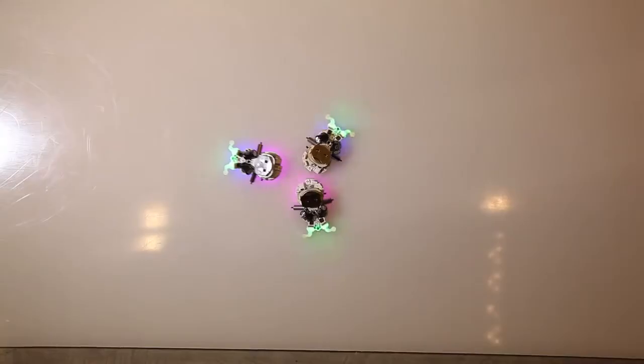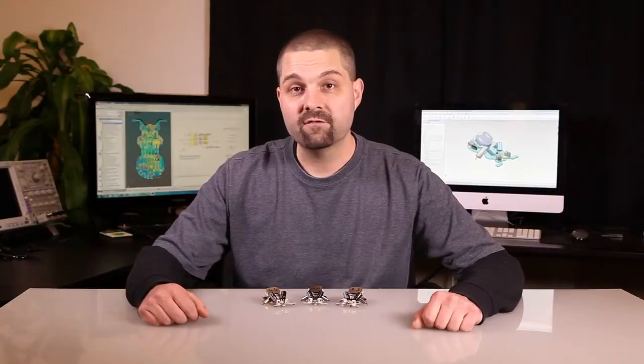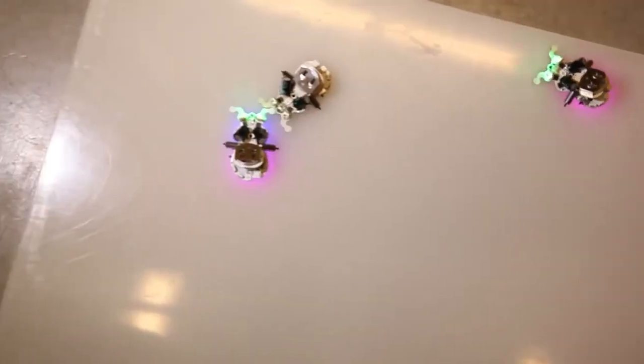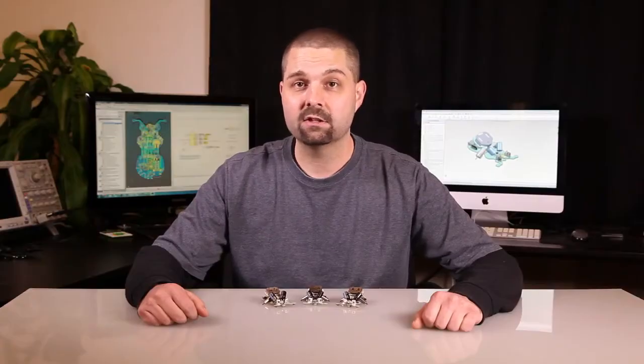You can also use this receiver to listen to wireless communication sent by other robots to enable group and swarming behavior. He has 3 infrared light sources pointed 120 degrees apart, which can be used to communicate with other Ringo bots, appliances like your TV, or used together with the light sensors to sense objects or movement nearby.